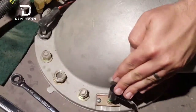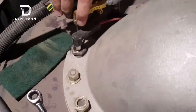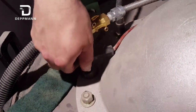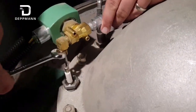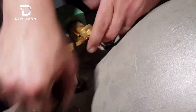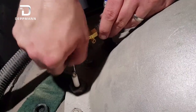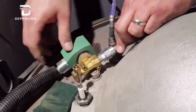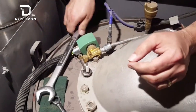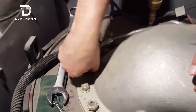Once you're done cleaning the flame sensor and putting it all back together, the other component we're going to clean is the igniter — the fan jet igniter, as Lochinvar calls it. It has a solenoid on top and an ignition wire. The ignition wire just pulls off like a spark plug. Then to remove the pilot solenoid, loosen it with a 7/16ths nut — this ferrule nut — which is just a compression fitting for the pilot gas line. Once that is loose, set the pilot solenoid aside. Then take your one-inch wrench; it is just a one-inch nut on the bottom. Break it free — usually once it's free it will spin by hand — and take it out.